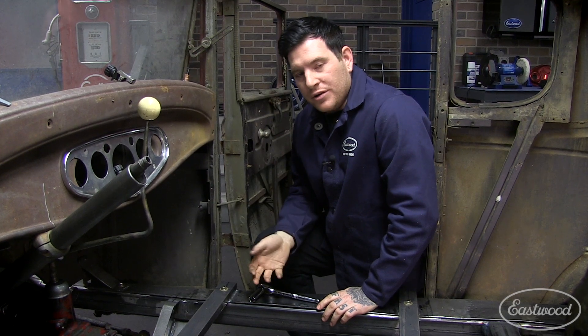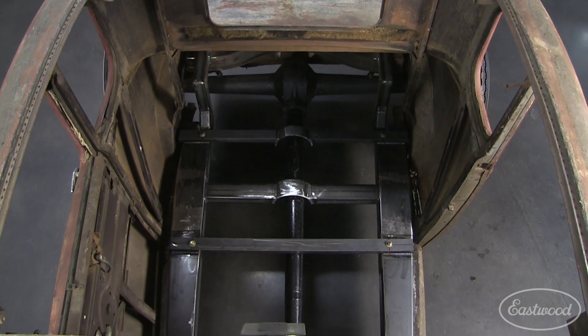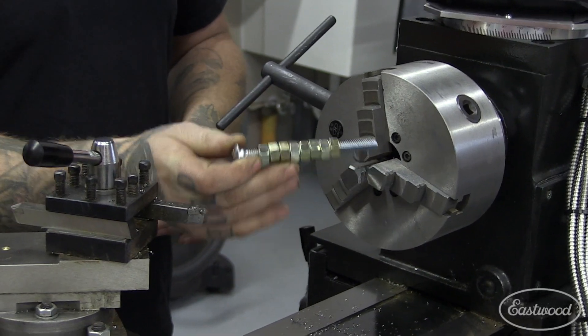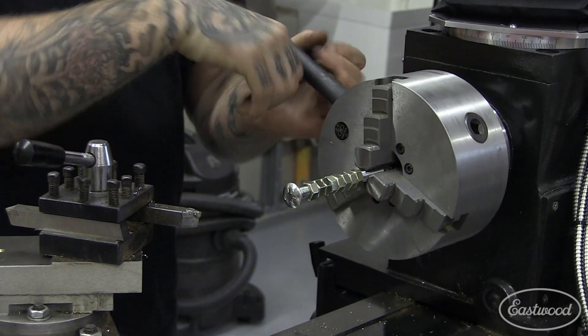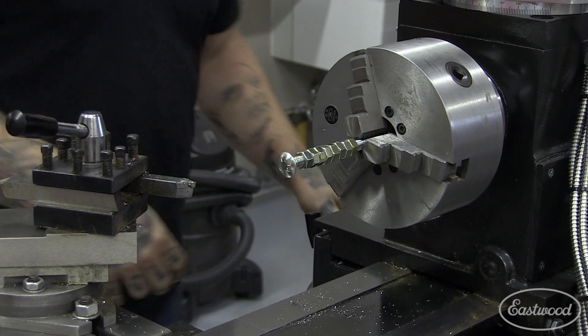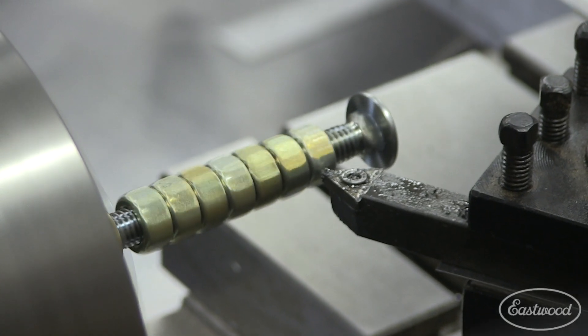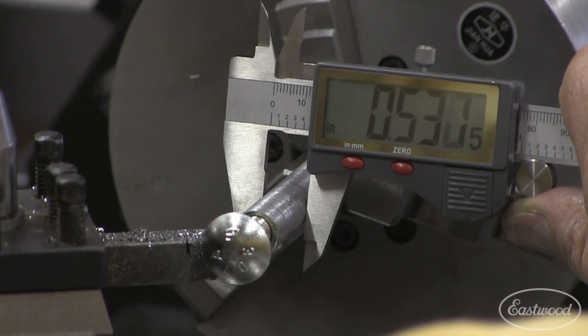I found a way using some hardware we had laying around the shop to make some strong threaded inserts that are fitted into the chassis and will last the life of the car. I wanted all of the hardware holding the body to the chassis to be grade 8, so I started by locking a batch of nuts onto a carriage bolt and chucking it up in the lathe. I then machined off the hex portion of the nuts, leaving me with round threaded grade 8 bungs that were just a hair bigger than half inch in diameter.